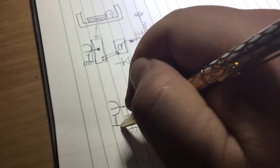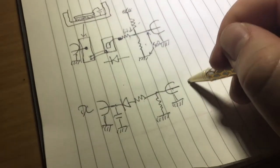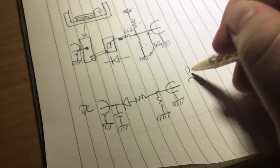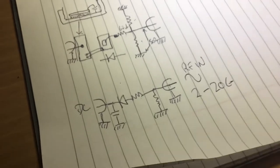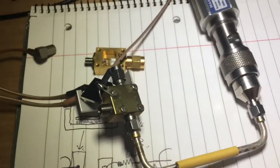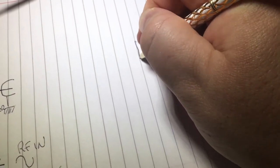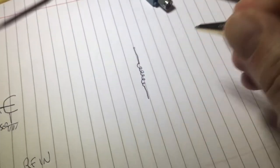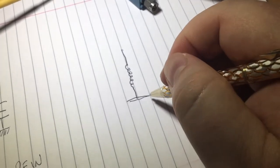The MCX connector provides the DC output, and the RF in is from 2 GHz to 20 GHz — that's basically how it works. Now the attenuator — when we looked at that RF attenuator, it had a choke, an RF line, and then what I thought were two pin diodes, one there and one here, with RF in and RF out. Coming off that was another trace going to a socket which went to this diode coupler.